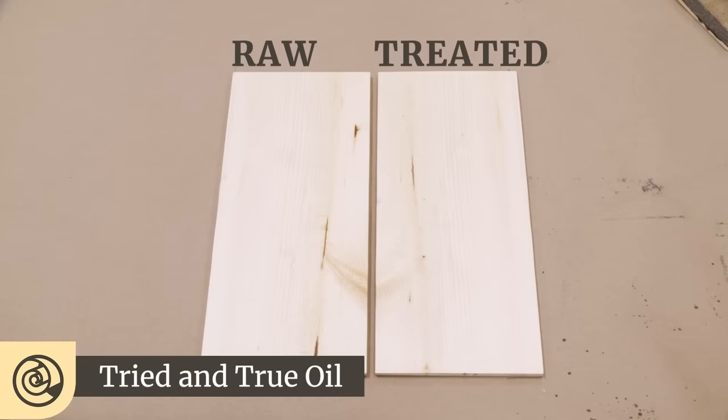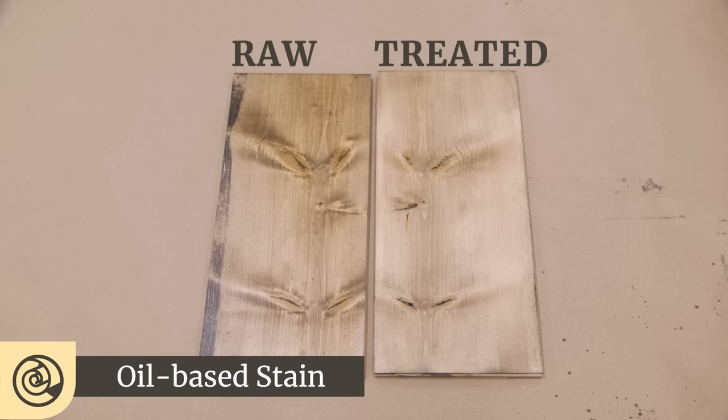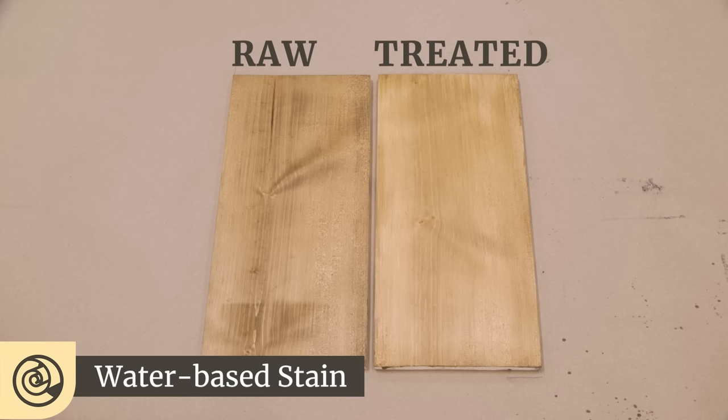The clear oil doesn't really show us a lot, but I do see the area around the knot appearing a little darker in the untreated sample and more subdued on the treated side. The regular oil-based stain — that's the one we've been using throughout this video — shows a clear change in the properties of that little strip on the left-hand side of the untreated board, and the area around the knots is very pronounced. On the treated sample, the knots are much less pronounced and we no longer see that strip, though the color is just a little bit less intense overall. For the water-based stain, we see similar differences — the treated board has much less noticeable knots while the untreated board is showing some interesting dark areas.